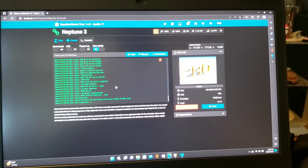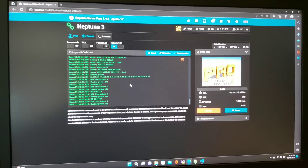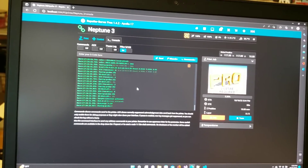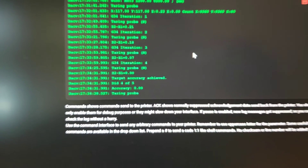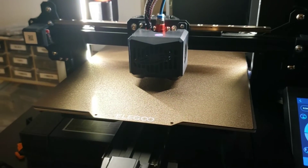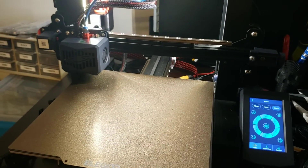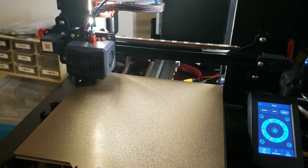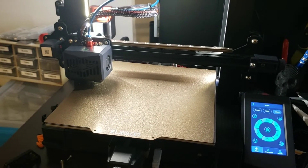I'll put you down for a second and come back when this thing is really whomping away because it's fun to watch. There's an M-code command in the program to kill the motors anyway, so it kills the motors which drops the auto gantry level. It went through its four iterations and you can see it's dead perfect across the two points. Now it's going into the auto bed level and — oh yeah — the Z is still the same speed, it's still slow. It comes down, touches, comes back. But those point-to-point moves really cook.